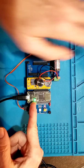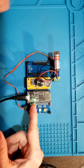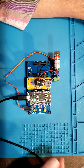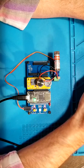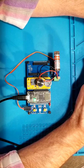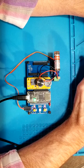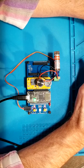Whenever this LED flashes from green to red and back and forth a couple times, that's actually it acknowledging that the contents of the file system on your Feather board has changed. And it's resetting itself, and it's restarting and running code.py again. And as you can see, there's now text showing up in this serial window. And these are the messages. Well, the top messages are actually the system part of the board printing out some stuff. But then it says code.py output, and these two lines are actually generated from print statements in code.py.